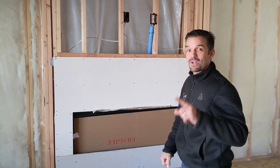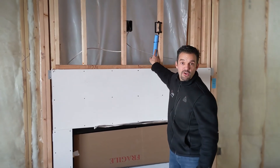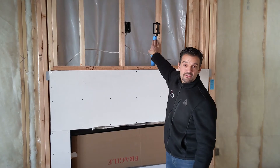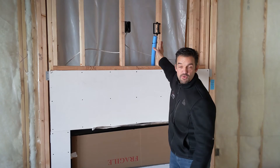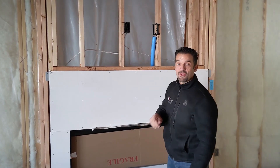But the good tip — I do want to close out with something good. There's a nice big piece of conduit here. A standard conduit will not work; you've got to go larger like this for the HDMI cable to fit through. The other thing that's really nice is they get the high voltage and the low voltage away from each other, so they're not going to get interference. Those are your tech tips for this Tuesday. Have a great Tuesday.